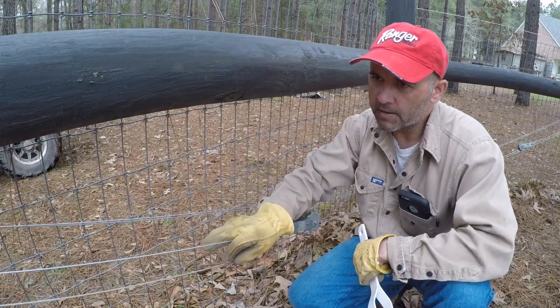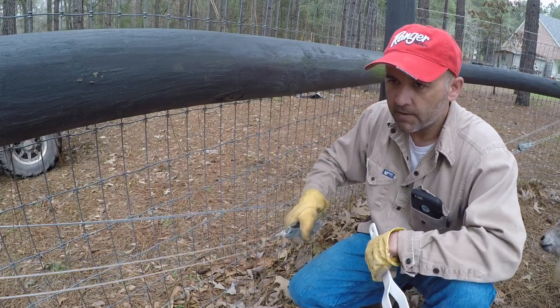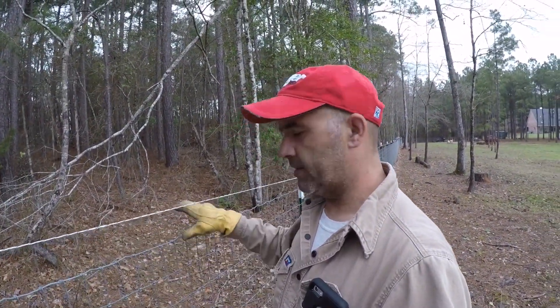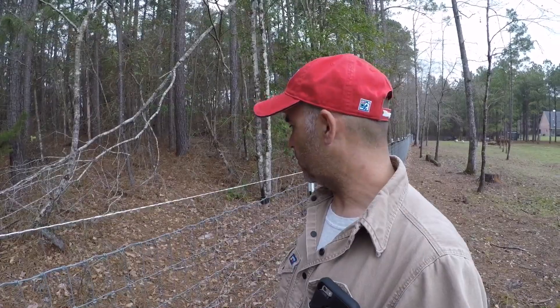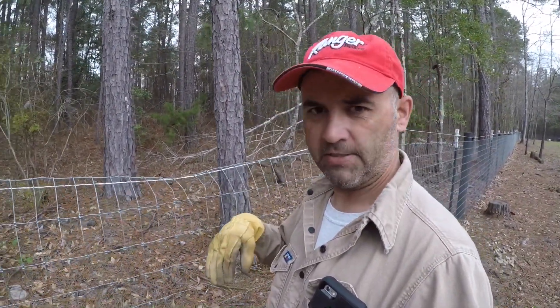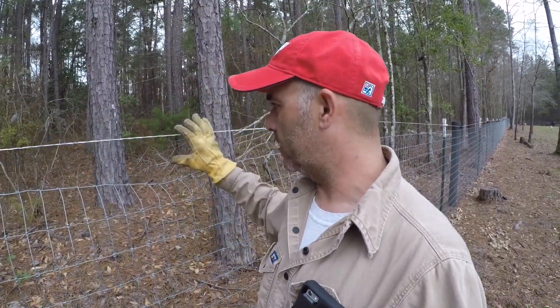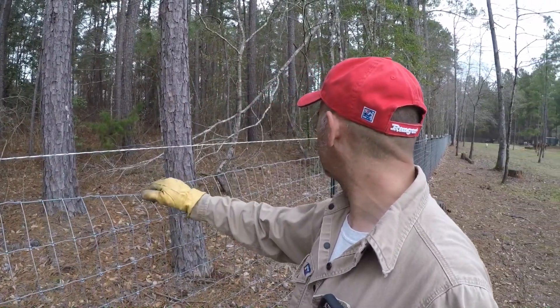This one here is pretty tight with one loose wire, and I think it will adjust itself out. While I'm walking my fence line, I'm checking to make sure there's plenty of space and that the wires are not grounded out causing a short. When I walk through here you'll see I've got one that's grounded out. Most likely a deer had jumped over, bent this down, and pushed it on top. You just check it, fix it, and move on to the next one.